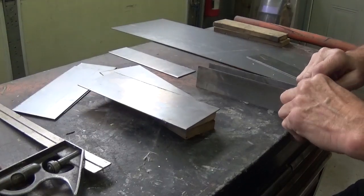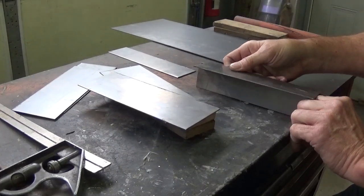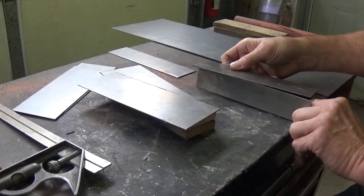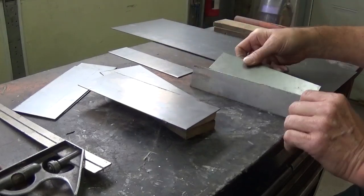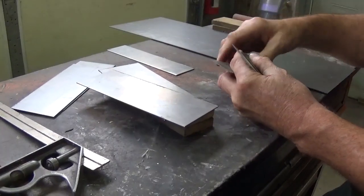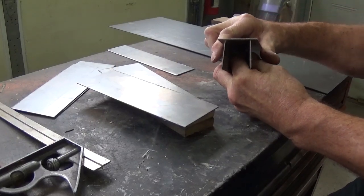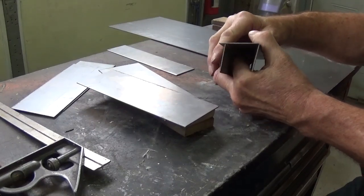1.5 inches is I'm going to weld 2 of these onto the inside of this, a 1/8 of an inch plus a 1/16, 3/16 more than an inch and a half. Okay, so something, you know, maybe sticking about that far, and then I'll weld that to that. So what you'll have there then is something that looks, let me see if you guys can see this. Yeah, it's going to be something that looks like this on the inside. That's going to grab a hold of the 1.5 inch piece, and then one of those side pieces, let me see if I can grab all of these.